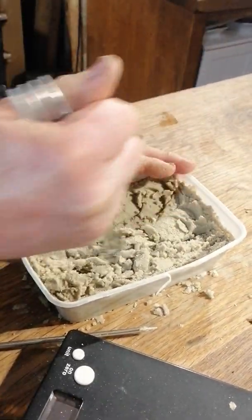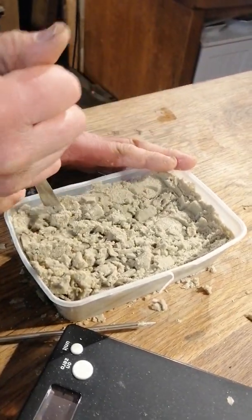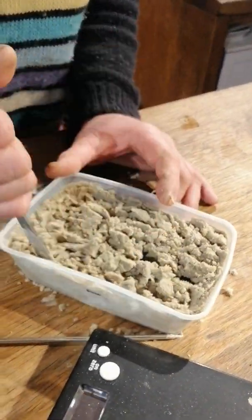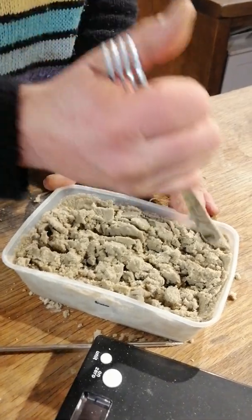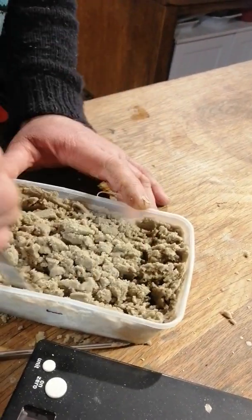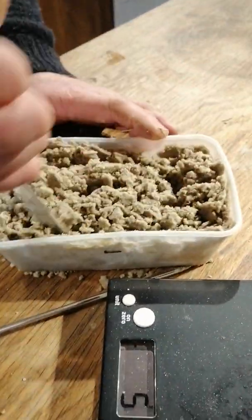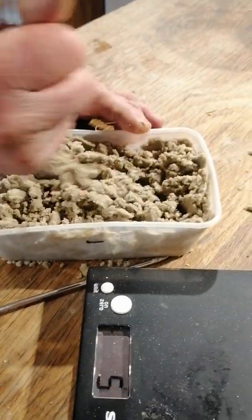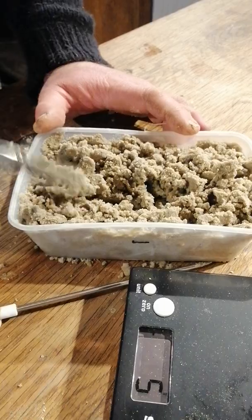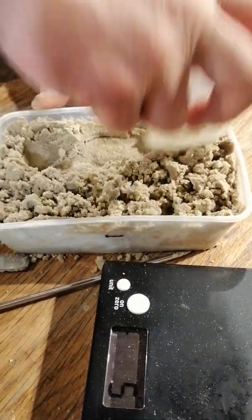Okay, that suggests it might just be better. Again, it's a bit counterintuitive, as they say, but it might just be better if your track is frozen to drive over it repeatedly with the tractor before you harrow it. That way, if you can break up the ice in the surface before you harrow it, you won't get those big lumps that are then virtually impossible to break up with the harrow because they just slide between the spikes of the harrow. And add a lot of salt.